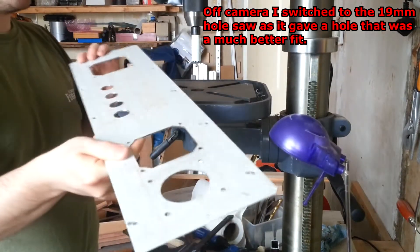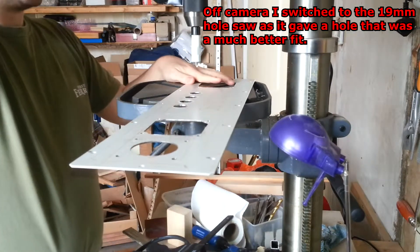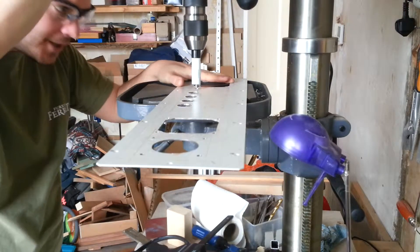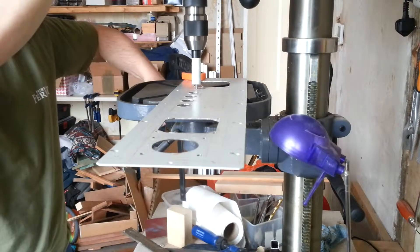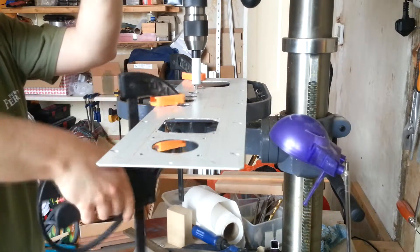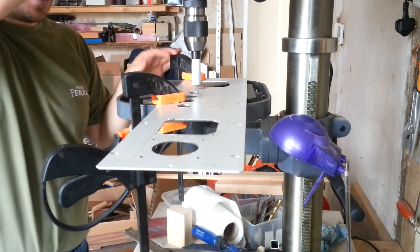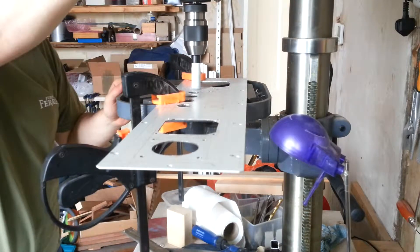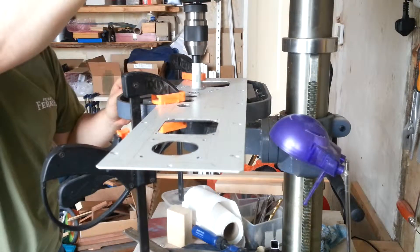So I've already done a few of the holes — I'll just quickly show you the way I'm doing these. Basically if you pin the piece of steel with the tip of the drill bit then you can clamp it into place, and you know that the hole saw will then be exactly in the centre. You'll get much less movement and a much cleaner hole. Don't force the hole saw — just let it cut down through, and it'll keep the hole much closer to the actual size.